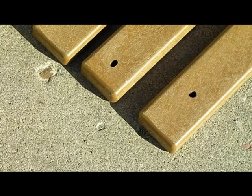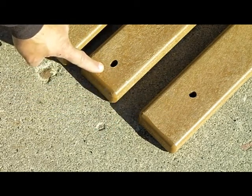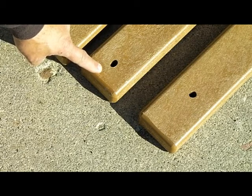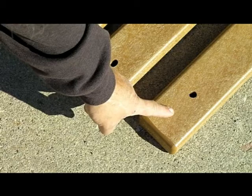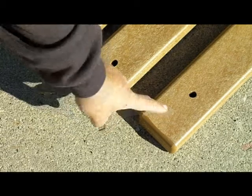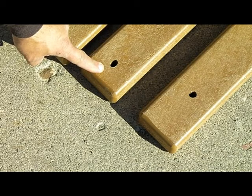The seven recycled plastic slats have slotted holes drilled three and three-quarter inches from one end and one and three-quarter inches from the other end. During assembly, the end of the slat with the hole three and three-quarter inches from the end will pass through the frame to align the hole in the slat with the hole in the mounting flange towards the center of the bench. The other end, with the hole one and three-quarter inches from the end, will align with the mounting flange towards the outside of the bench. The hole locations alternate from slat to slat.